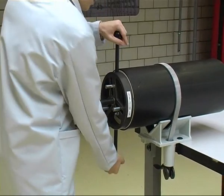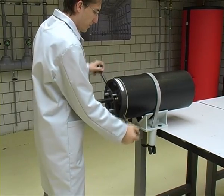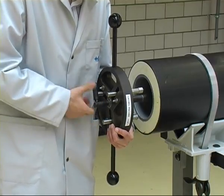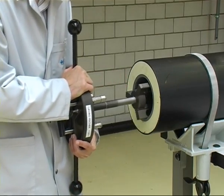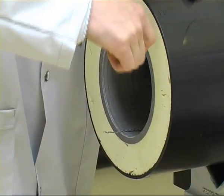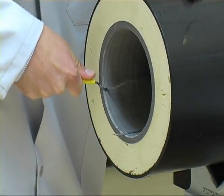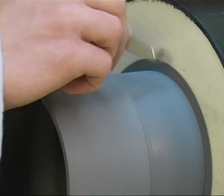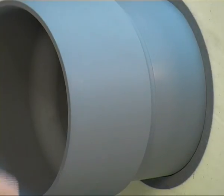When the correct calibration depth has been reached, the tool is rotated anti-clockwise to remove it from the pipe. Loosen the jaws and remove the tool, taking care not to scratch the inside of the pipe. After calibration, chamfer the inside of the pipe to an angle of 45 degrees using the deburring tool. The suitable double nipple can now be dry fitted to test the calibration. Try to introduce the test gauge into the gap without undue force — you should not be able to insert the gauge completely into the gap between the double nipple and the calibrated pipe.